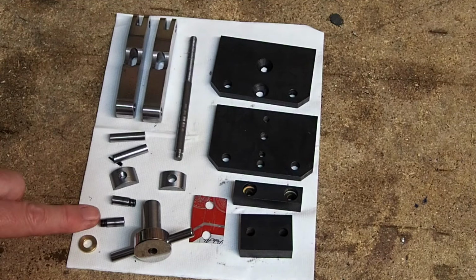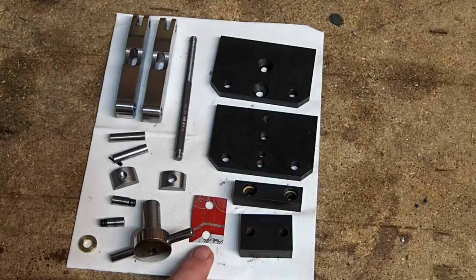The axles were just polished back to a bright metal, which took off the colour from the hardening process. I cut this shim from a piece of beer can, Old Speckled Hen if I remember. This just spaced out the side plates a little bit more. Now the arms are moving nice and smoothly with no play, definitely not binding.